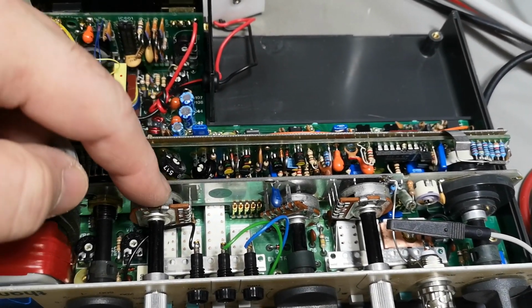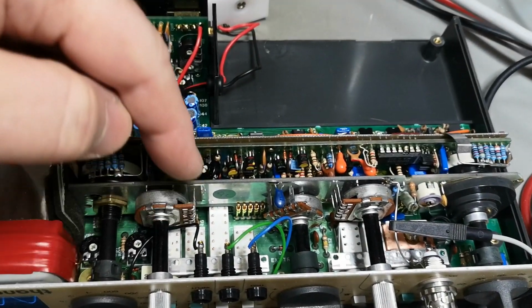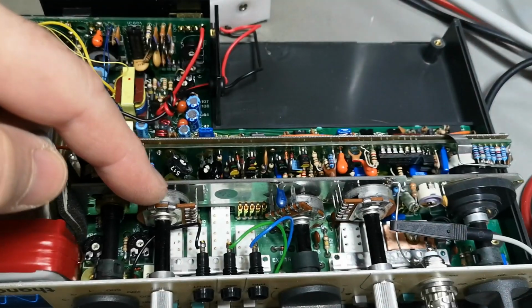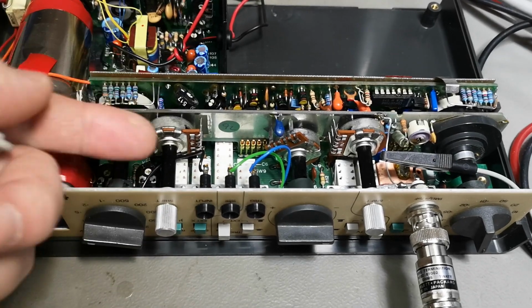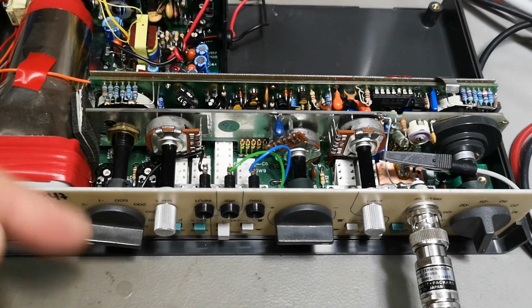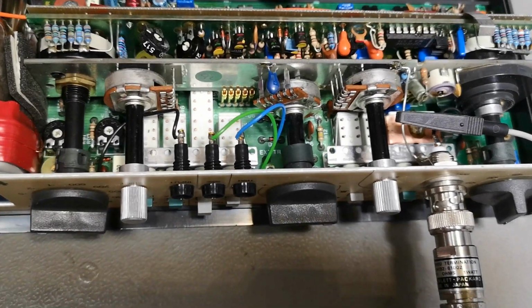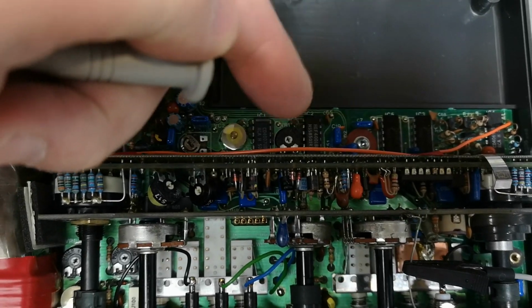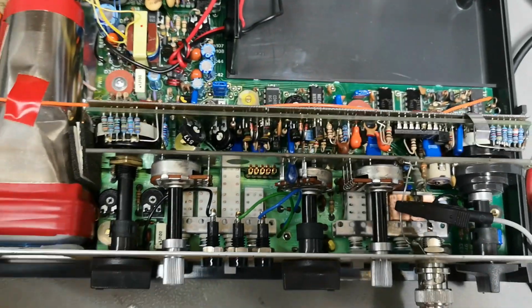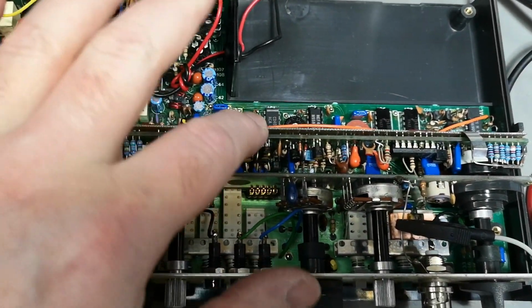The first thing I was checking was the position pots, and I got plus minus 5 volts on each side, and the position voltage here goes of course perfectly fine between plus minus 5 volt. And then I figured, oh well, what happens with my sweep ICs, the one handling sweep here on IC2, and then I was starting to measure that, and suddenly poof, I got picture and everything is stable. So, and I think I just pushed this board a little bit here.